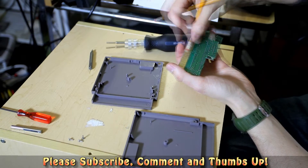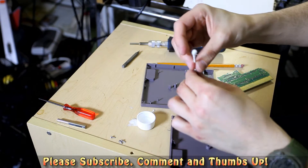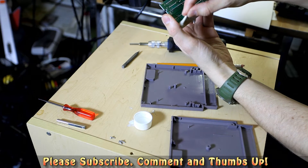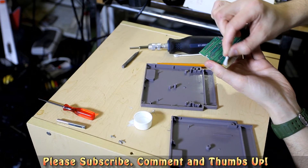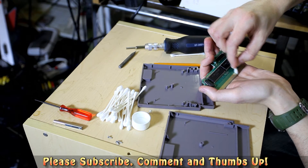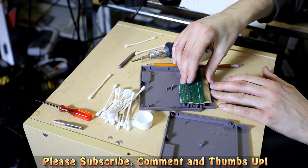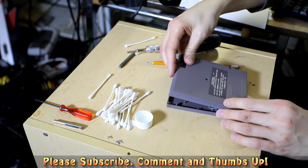It was working though to some degree, but I really got to invest in one of those white erasers. So I went back to the alcohol — it's 70% rubbing alcohol and we're going to hit the board with that too. The trick is to just sort of scrub it on there and then use the dry end to dry it off. Try some on the other side — clean up that 30 years of gunk on there. I guess when people were blowing in their cartridges before, it was putting moisture on there, so there's like bacteria and some rust in there.